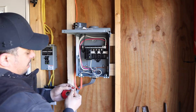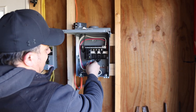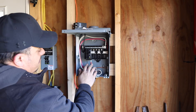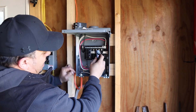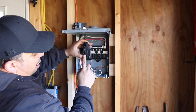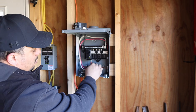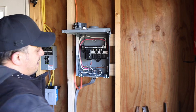There might be some electricians watching — you could take a piece of red electrical tape and flag that wire to indicate it's hot. In a 220 circuit, that's what you use. Now, if this were a 120-volt circuit with a single-pole breaker, you'd run a ground to the ground bus bar, a black wire into the breaker, and the white wire up to the neutral. For this heater circuit, we're using white and black — those are snug, secure, and tightened into the breaker. That one's done.